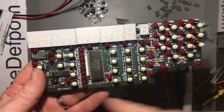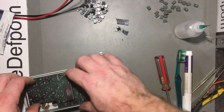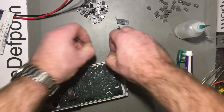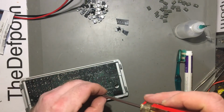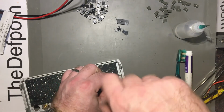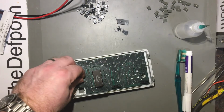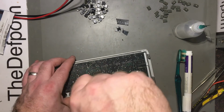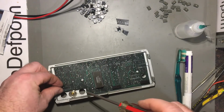Okay, so I've got the switches all installed. Now, next thing I've got to do is just double check that the actual alignment is okay. So I'll just get it sort of in there and put the screws in and just make sure that they actually seem to be okay. This can be a little bit tricky because you've got to kind of work out which of the many switches are the ones which are causing the problem. So you might have a few which are close to the edge, but it might not actually be those ones which are the problem, and some ones the other end which are the problem. So anyway, it's just one of these things. So just pop these in.